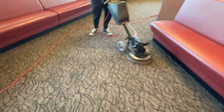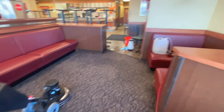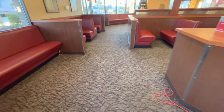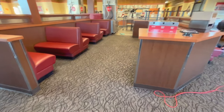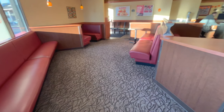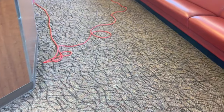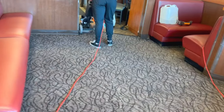The follow-up step with the Swirly and the pads — this light carpet will show shadows. You know how if you brush a carpet one direction it's lighter, and pull it back the other direction it's darker? That's what you're seeing here where the passes went in different directions. But I can assure you — night and day. Now you can eat here. The Go Oxy I used as a booster is a peroxide-based brightener, so it will continue to oxidize and brighten the carpets as it dries.